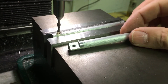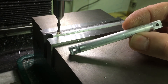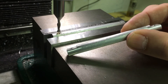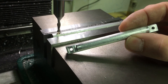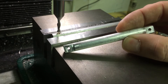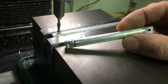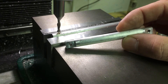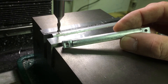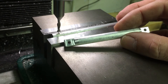Morning guys, we're in the machine shop now. This is the idler shaft — the old one. I'm gonna make a new one. This is the idler tensioner shaft. I put some flats on it, which I don't know if I need to do or not. It's a little too narrow from hole to hole, center to center. I made an adjustment on the width of the frame and this ended up being too short, so the new one I'm making is just a little bit longer. I'm going to put slots in there so I can make a fine adjustment on the width of the frame and the belt if I need to. I don't think it'll influence how the tensioner works — it can slide around a little bit and I think it would be fine.